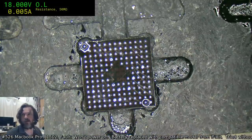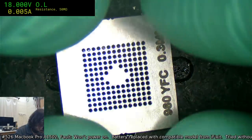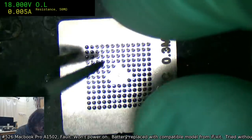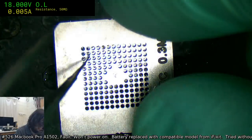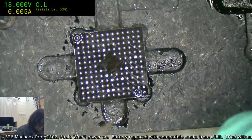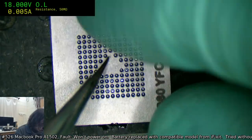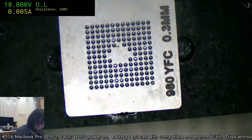Right. It really, really, really does not matter. Because the only purpose of... I've got a piece of junk in there. The only purpose of those initial ones is just simply to give us a stencil alignment, but what we don't need is junk on the stencil. So it just lets us hold the stencil in place while I'm doing what I've got to do.